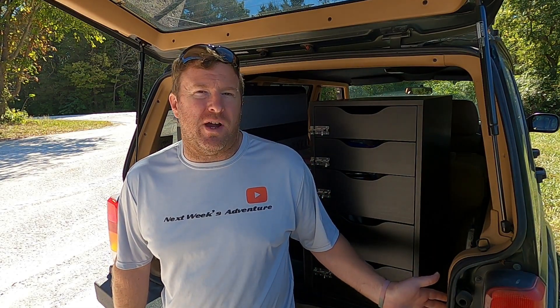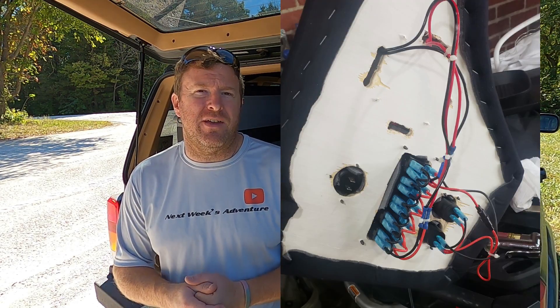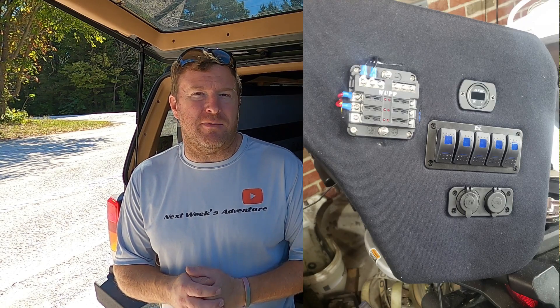For the five-panel toggle switch, it comes pre-wired which wasn't terrible. On one circuit I pulled one switch out onto its own separate circuit from the rest of the switches. I wanted it that way because if charging the Jackery pulls too much amperage it could take out all the other stuff — by putting it on its own circuit I'm not worried. If it does blow the fuse it's not going to shut off the lights. I'll put up some pictures showing the back side of this panel and how everything is wired in. If you know electronics it's not terrible, but if you don't it can be a little difficult.